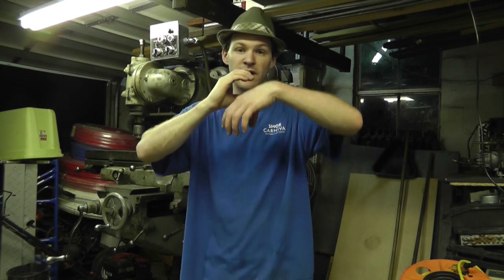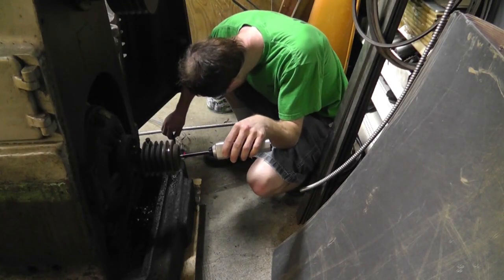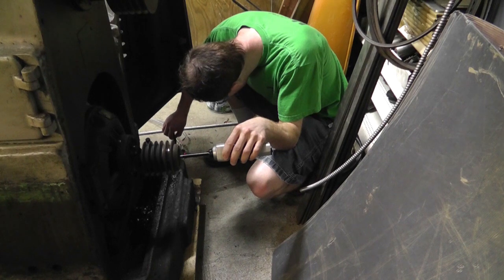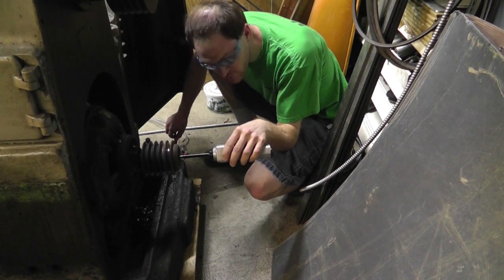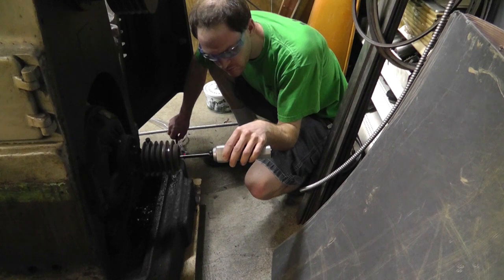So as the encoder pulses go this way, the motor turns this way. And I can go as fast as I want, and the drive will output a frequency at that rate. And I've tuned it where it runs exactly at 1,750 RPM. Heard something click. Anyway, I'm manipulating the drive to think it's sitting still, but it's actually running at full speed the wrong direction. That's what's happening.